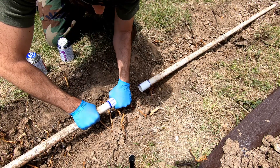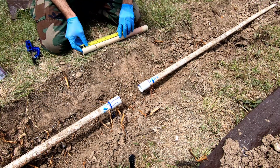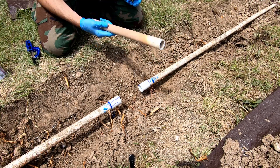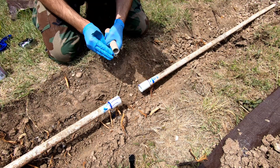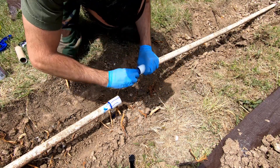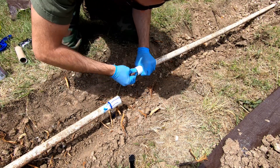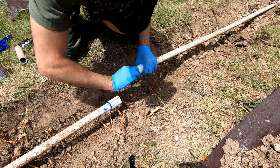Make sure you give it a little twist before you hold and let it set. For this, the instructions say 30 seconds to set. Luckily I had some of this schedule 40 pipe laying around left over from another project. Make sure any residual water is out of there — it's dripping a little bit — and clean up any excess glue, as some of that glue can build up in there and won't let you slide the pipe in. And always do a dry fit.